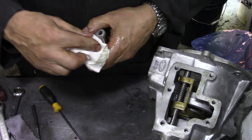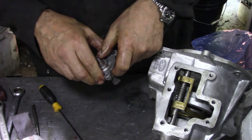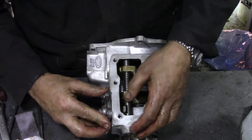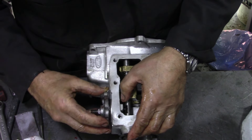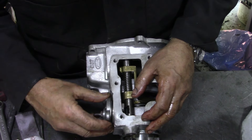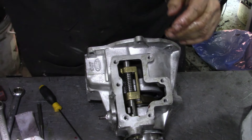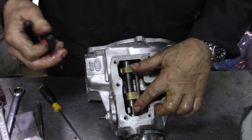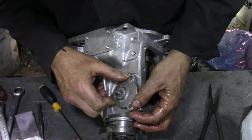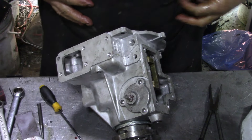Now pay attention when you do this, because these bolts here aren't equal — all men are born equal but some aren't. You can see the flat down here. We'll arrange that flat into there, but we're going to turn it so it's at a place where we can get the bolts in. Keep looking at this piece here, turn the shaft till it's flat, push this in a bit, and arrange to see where the bolt holes are — and hey presto, there they are. Now we can push that in — there we go, that's in.